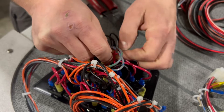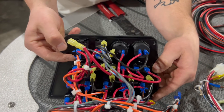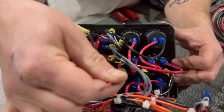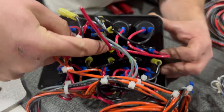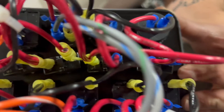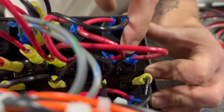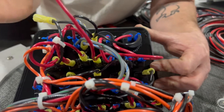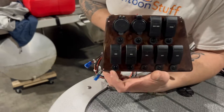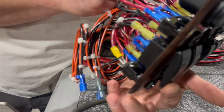What I've created is basically I've put my chargers on their own little power source, and it's all going to be fed from this wire right here. When I supply this wire power, it's going to run into the breaker for the 12 volt so the breaker can supply power to the 12 volt charger, and it also piggybacks across to the breaker for the USB. So essentially all I need to do is get power to this wire that I cut free from my navigation light breaker. Our aim is to use this switch to power those on, which happens to be set up right now as a live well switch.